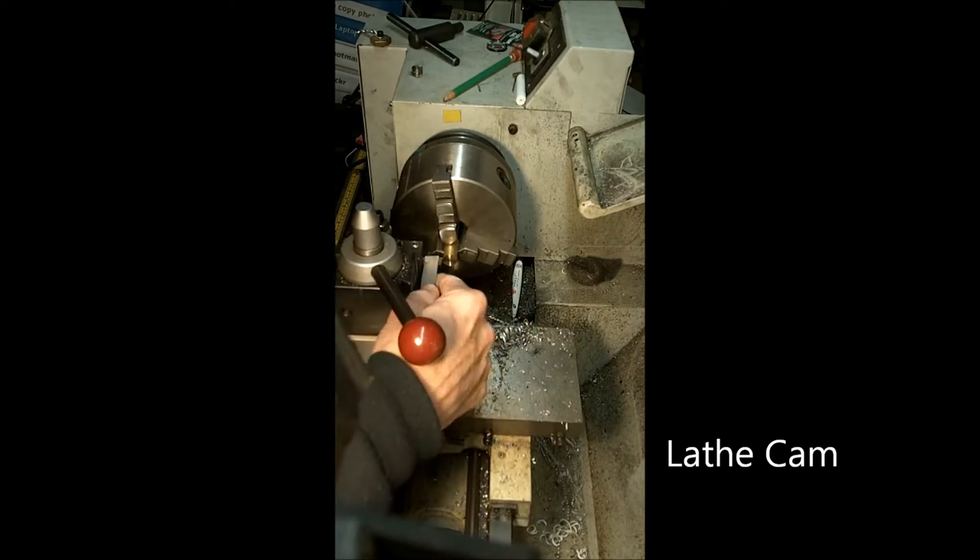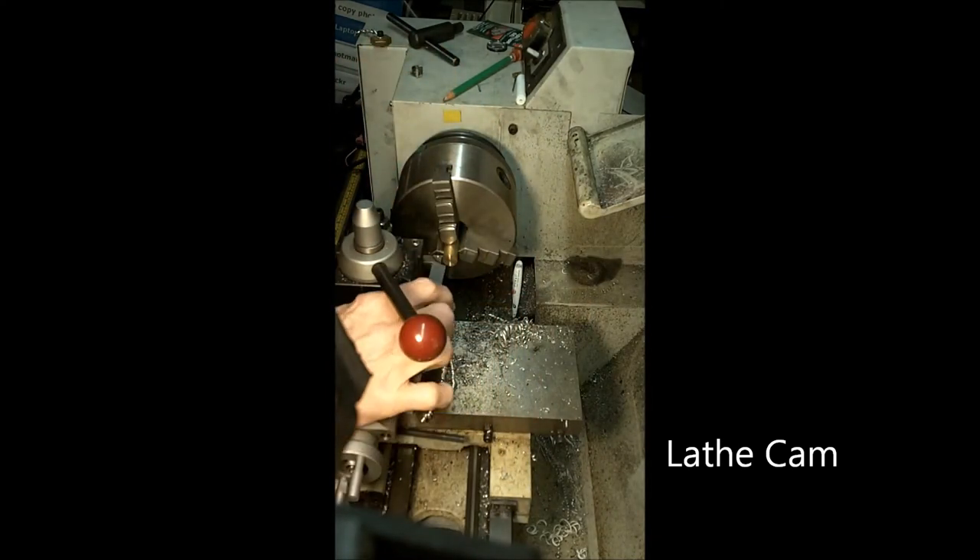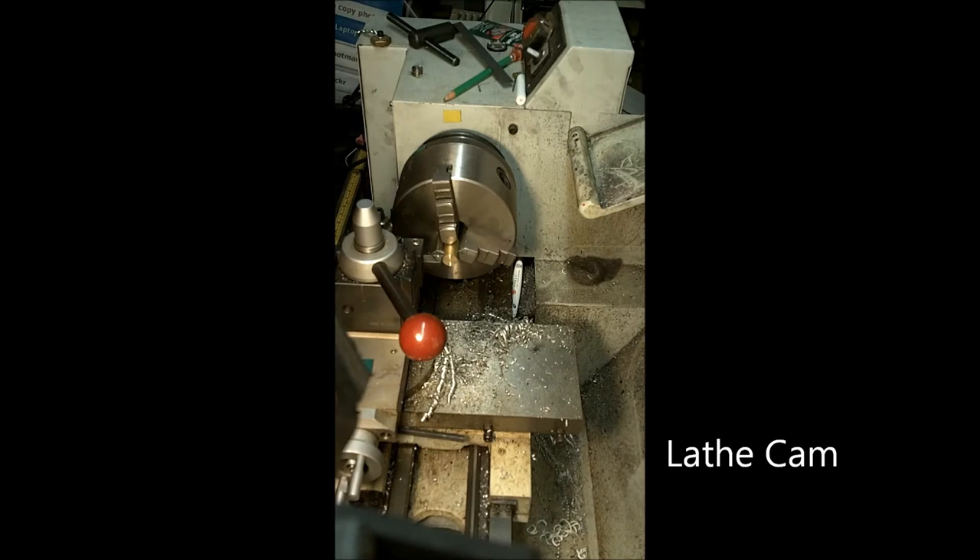I'm going to come down a quarter of an inch here. When you're working with inches, you can work using the ruler and so forth. You can go as precise as you like or not — that's totally up to you. I'm going to make it slightly bigger than a quarter of an inch just to plan with. I'm going to set my lathe and lock it so I get the same thing every time, by locking my carriage when it gets to a quarter of an inch, and we're going to turn it down.